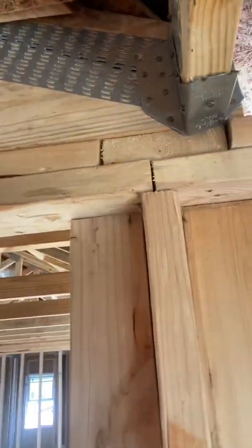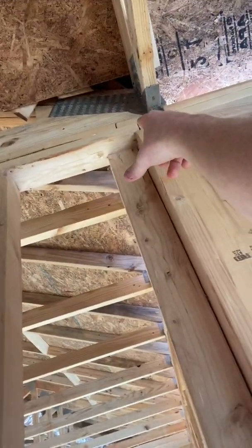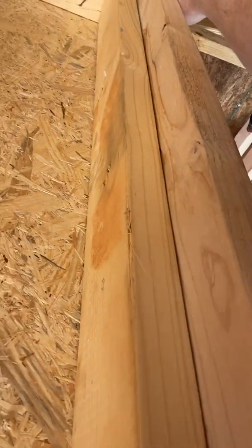Code coach — today we're talking about inside corner intersections. Note here you see the top plate and your double top plate, and then you have your lap. They did a good job of lapping that, and right here they butted this wall up, however it's lapped at the top. A lot of times they stand these walls up on the ground and they don't lap these wall top plates, and those top plates are what lock in the walls and allow for that rigidity of the wall section.